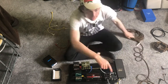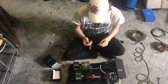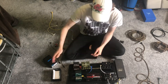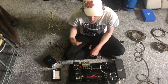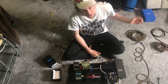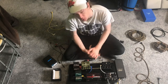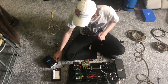Next up, power. The way I think about power is you want to keep the cables as short as possible. You don't want loads of extra length of cable flopping about on your board if you can avoid it. This power supply has higher amp versions of stuff. I tend to put that towards more power hungry pedals. That tends to be pedals which have digital stuff going on, stuff with pitch tracking. Things like drive or a tuner, they can go without as much power. They can deal with that.